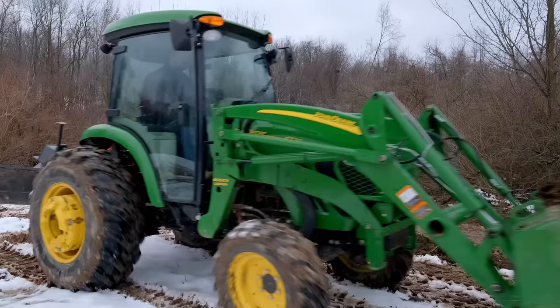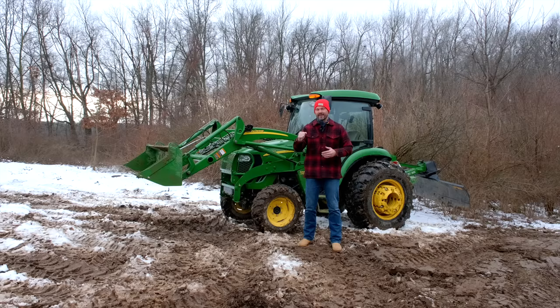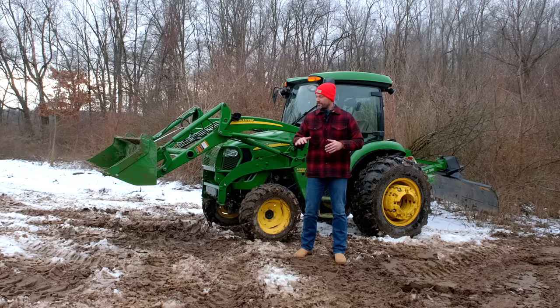But once you get good at it, get the hang of it, you can start to do everything at one time, right? You can keep your motion going forwards or backwards. You can pull it in and out of float as you need to. You can adjust the angle, the curl, the roll function on your bucket or your pusher or your grapple. Same thing in raising and lowering. So that raising and lowering of your loader is going to make a huge difference on maintaining traction here.